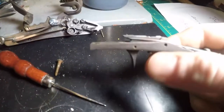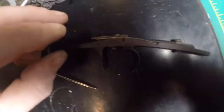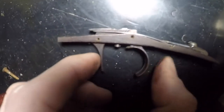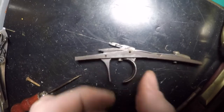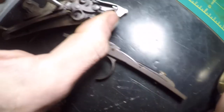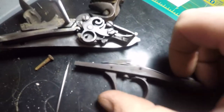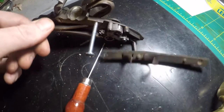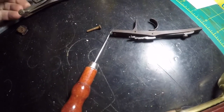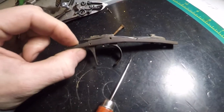With the set screw, it sits higher so when you go to release, you just gently touch it and it falls off because the rear trigger will be below that. The rear trigger is now below, so when you touch that front trigger it starts to lift up and fires. When I pull here, that goes up and releases that cock. That's mainly what's going on with this gun's trigger mechanism.